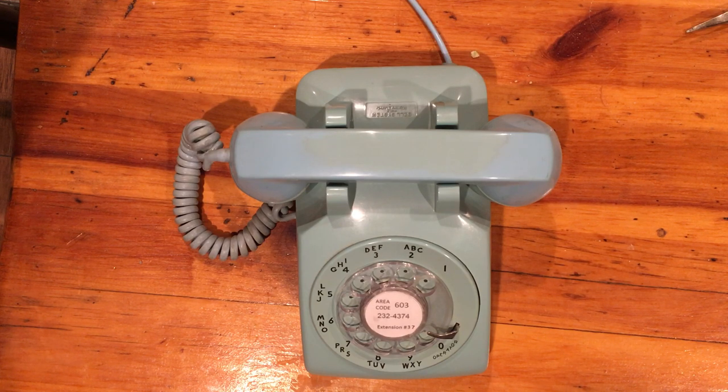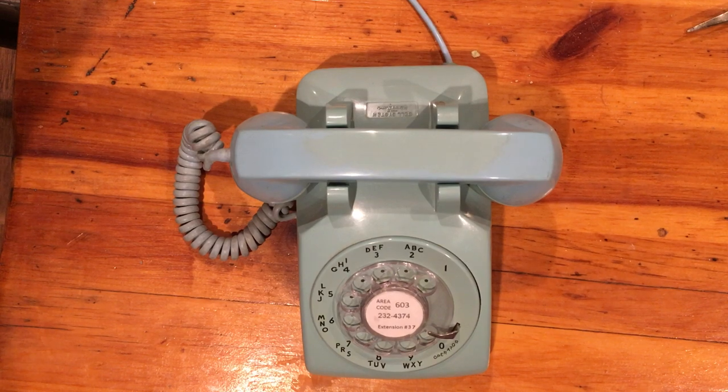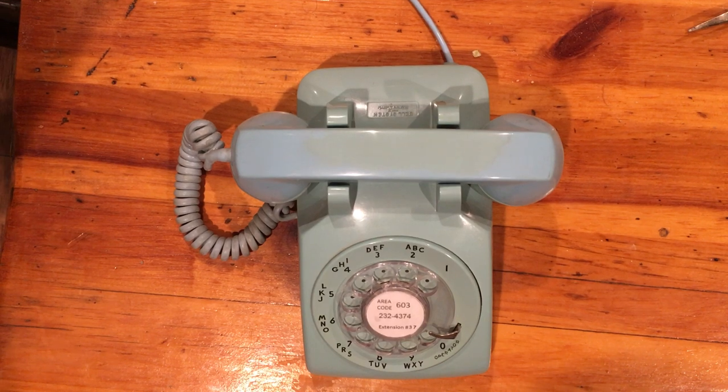Typically a copper telephone line is 100 to 105 volts at about 20 Hertz, and it's a nice clean sine wave. Modern VoIP devices max out at 85 volts — some are as low as 40 volts. They're just awful.